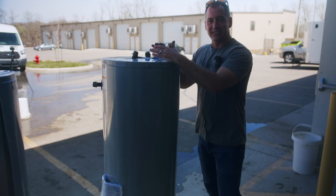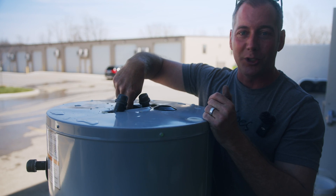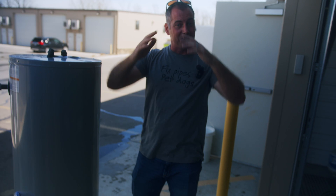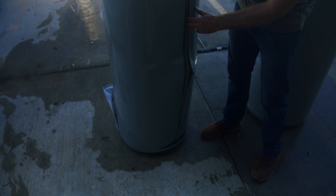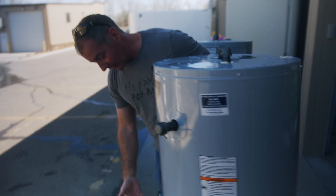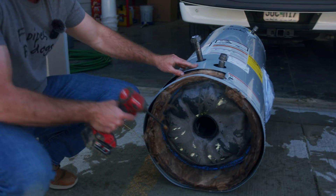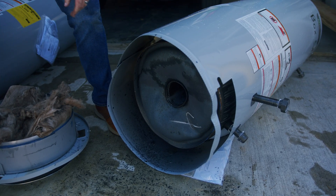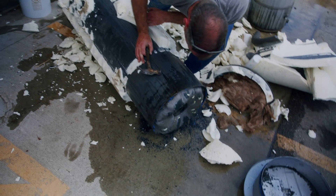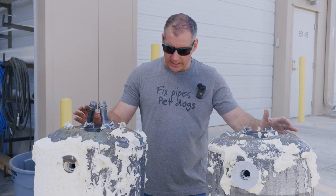Inspecting the damage: the pro grade unit's nipples, which started straight up, are now bent and pulled over — they actually ripped into the metal. The flue connection is displaced, but the jacket and internals are fine; it just folded everything in on top. The box store unit ripped the jacket open, moved fittings around up top, and sunk components down. At the bottom of the box store tank you can see severely distorted, swollen metal — it failed at a single crack where it finally popped.